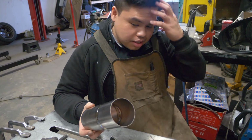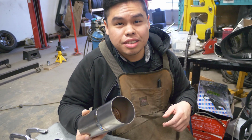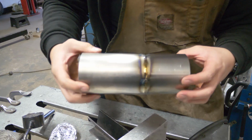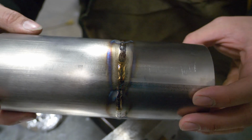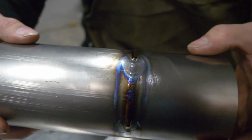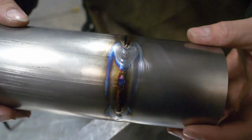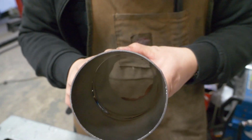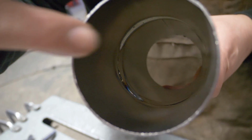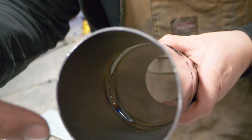All right. So, showed you some ways how to weld titanium and how not to weld titanium. Again, we could see here, this is essentially how you want it to look with these colors. Less color, the better. And not like this, where you have contamination, dirty tungsten, and then we'll see. Look on the inside here. Basically, I got a light we can use. You can see how on the 3/4 where we have the purge on the inside, you have full penetration, you see the beads, no discoloration.